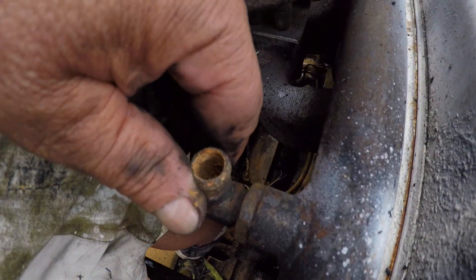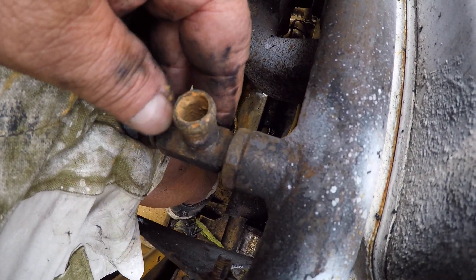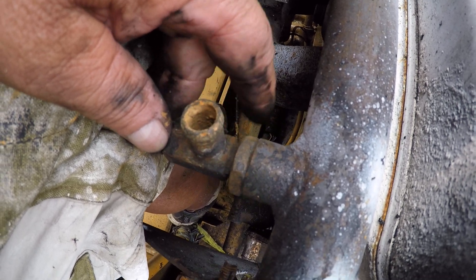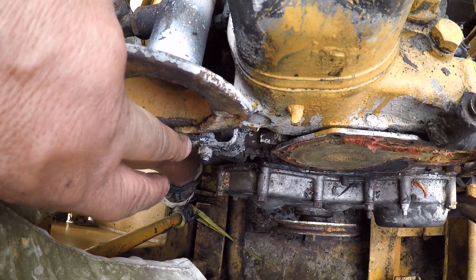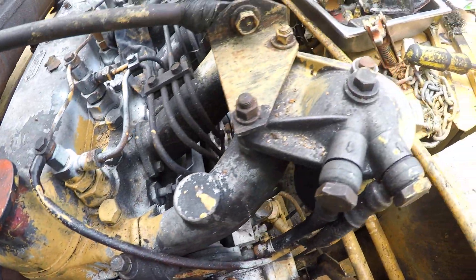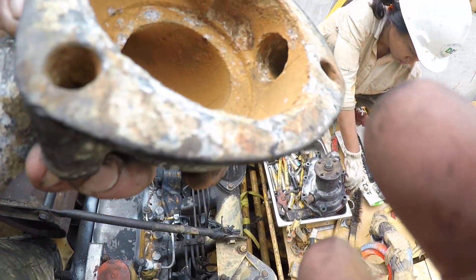This valve is solid locked shut. Because water was leaking out of this bell housing, they used water instead of antifreeze, which is why the inside and outside of these fittings and the bell housing are so deteriorated. They used straight water since the man brought the machine here — could have been going on for I don't know how many years.